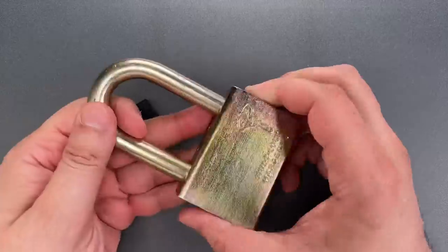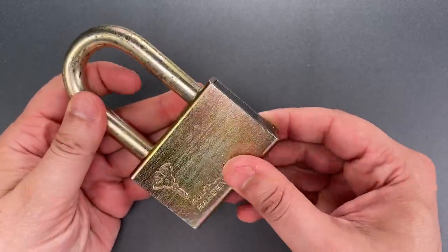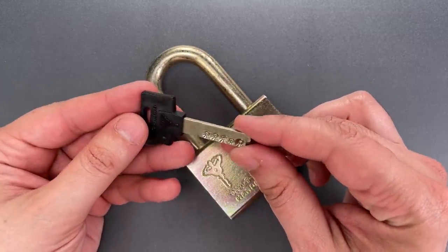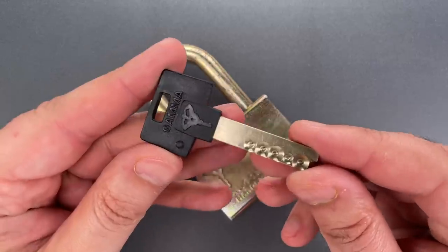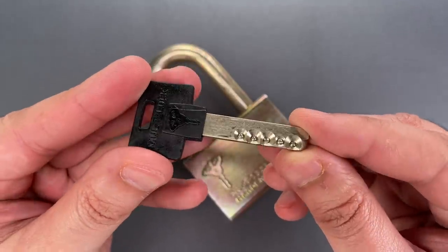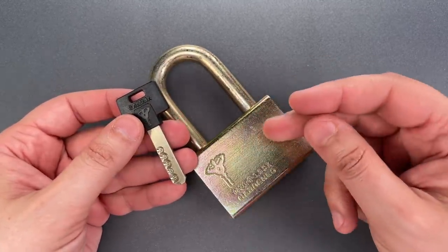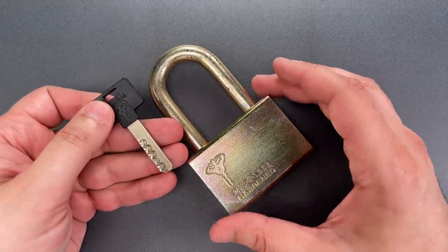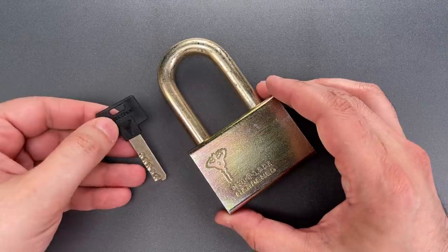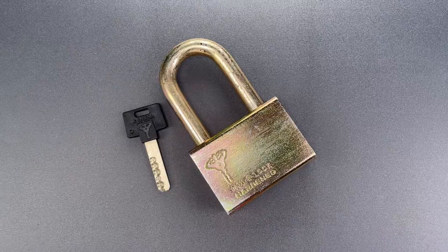What you see here is one of Multilock's earlier C13 padlocks. The C-series design is pretty solid. The issue was with the completely open keyway that Multilock called Gamma. If we take a close look at the blade, we can see it is a solid bar of metal with a bidding cut into it. This was apparently subject to a foil impressioning attack, though I've never been able to get that to work on any of the three Gammas in my collection.